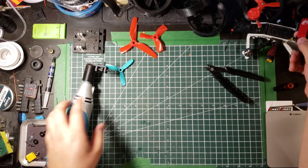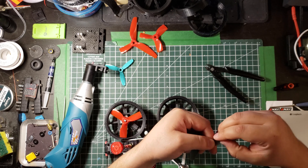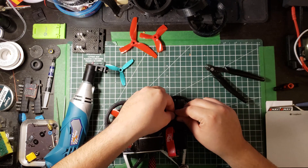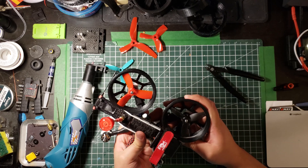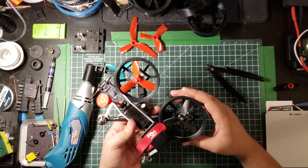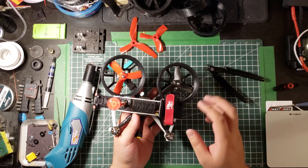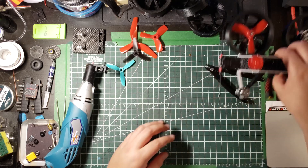When fitting, grab some of the flashing you get when cutting these down and make sure that's gone. This is still just a test fit — you'll put it on your motors and make sure it's fitted properly and spaced accordingly. All of a sudden you have a nice free-spinning prop with as little gap as possible. You're going to want to cut a couple of sets and give it a test to see what works best.